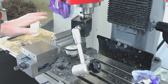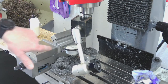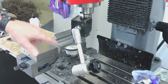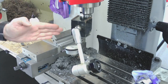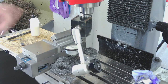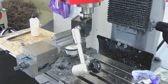I've not checked anything yet so I just did that nominally to see whether it was the same - and it probably won't be so I might have to take that back out. Because I've machined the first V in now, I've got a nice vertical face and a nice horizontal face to get the clock onto. I'll run the clock up and down the vertical face to check this way, and then I'll do the horizontal face to check whether I need more shim, less shim, or leave it.